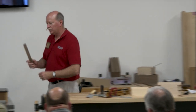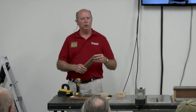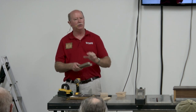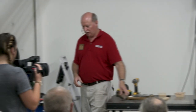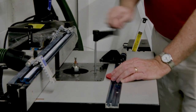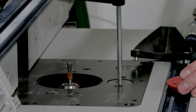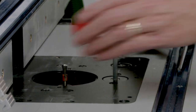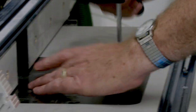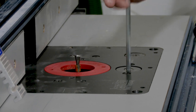I'll make up two blanks — in this case walnut, just one inch square — and I'm going to cut one slot on each end, then cut them to length afterward because I want to work with a longer piece I can control better. I've got my 3/8 inch dovetail bit in the router table. For anyone interested in router lifts, my favorite is the Jessem Mast-R Lift — best one on the market. The second best is also a Jessem model.